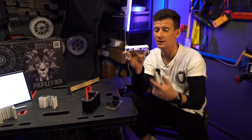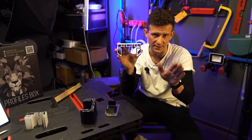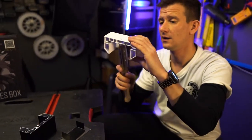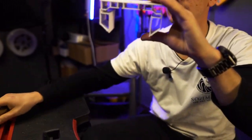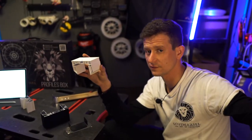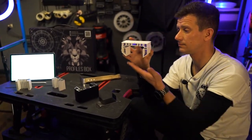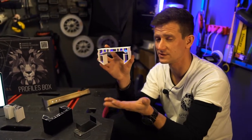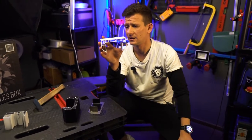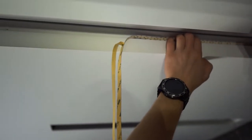You can also place LED strips here, but we have one main recommendation: please do it after installation of the stretch ceiling, because you can damage the LED strip using the spatula or a hairpin. You need to make measurements of your LED strip length, connect it to electricity, and then stick it to the construction using duct tape or any method you prefer. After installation of the ceiling, paste it precisely in place and the result will satisfy you.